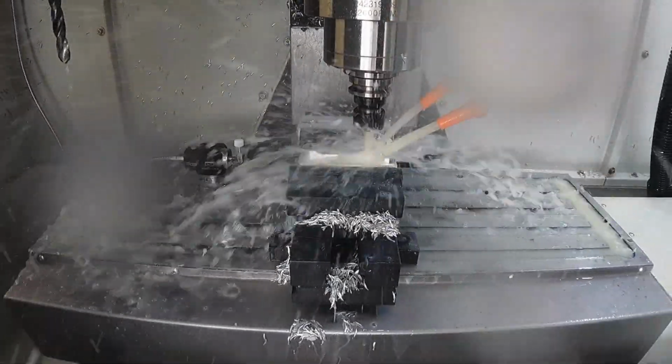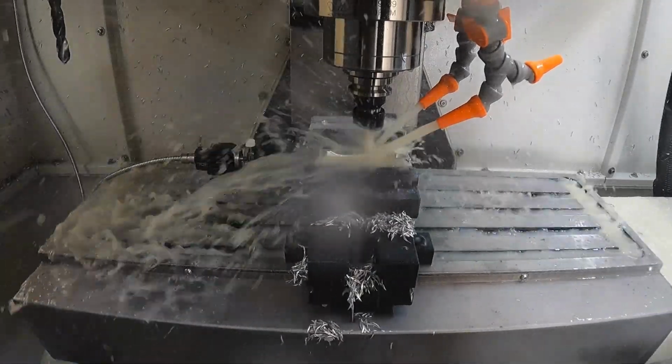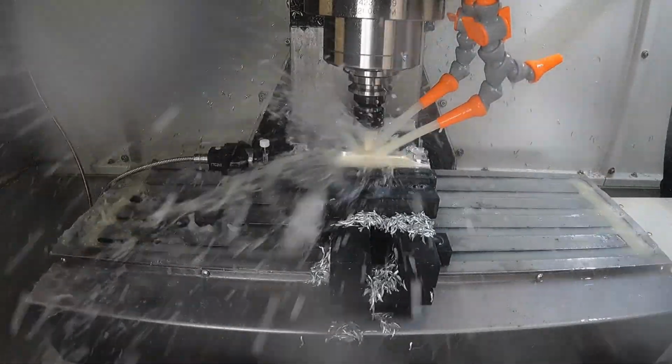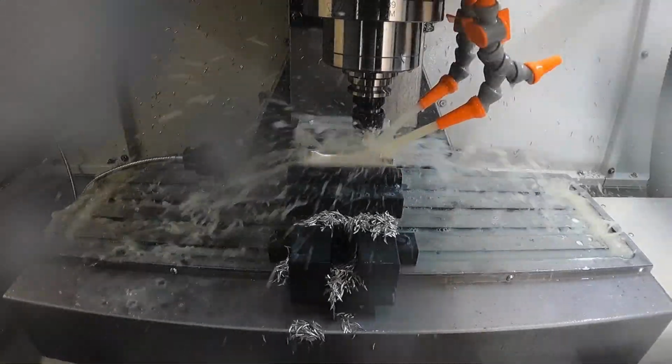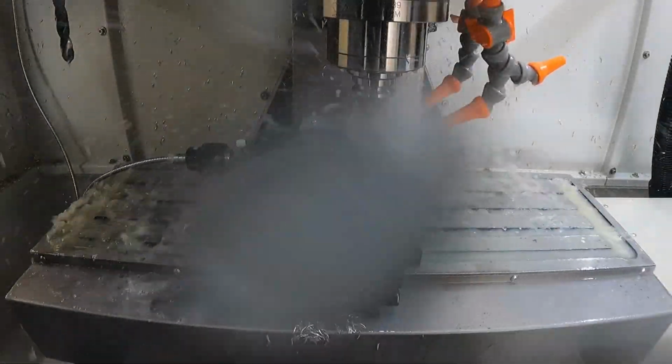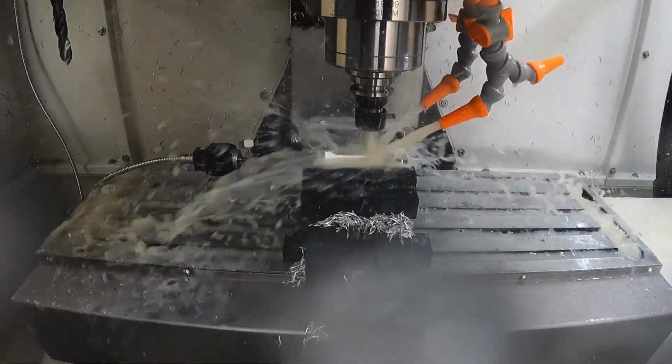Like I said, there are 3 blend tool paths on there. The left, the kind of the front side, the top side, and I mirrored it to the opposite side. I'm liking this blend tool path. Basically, the way blend works is you specify the surfaces that you want machined, and then you specify 2 drive curves where the tool path will morph between those shapes.